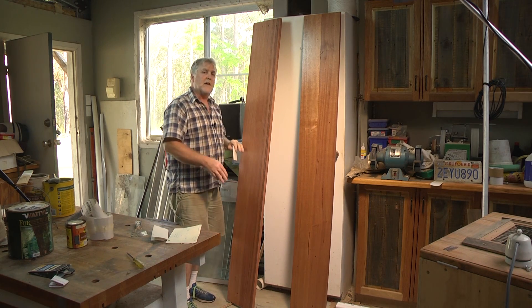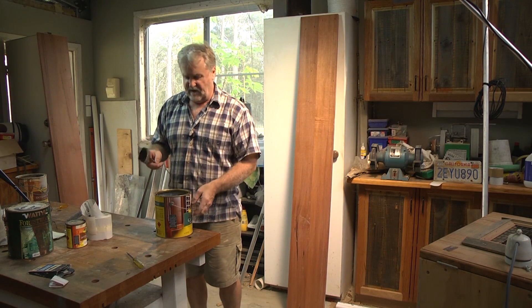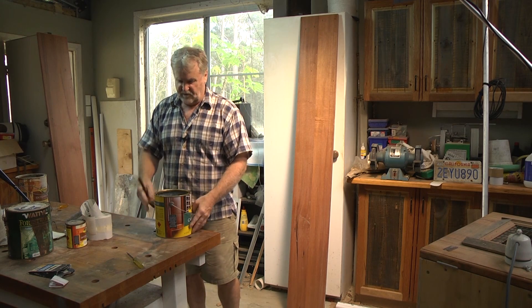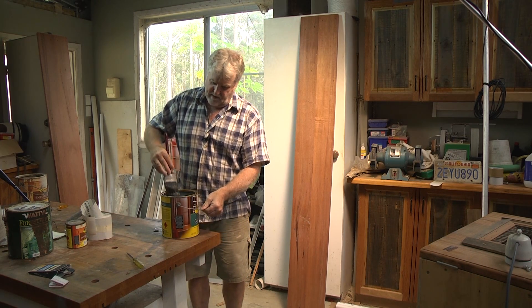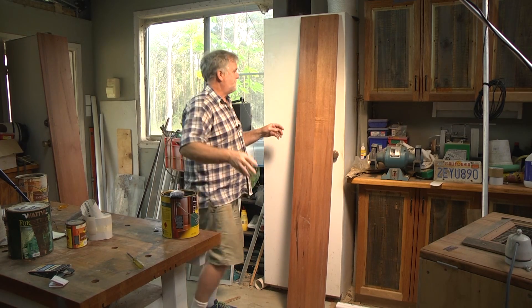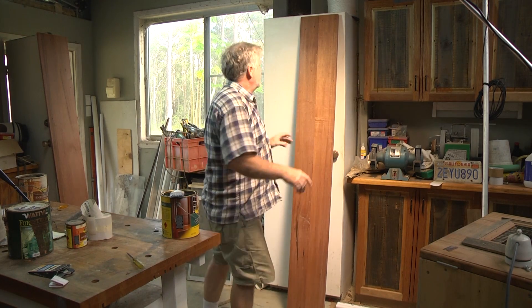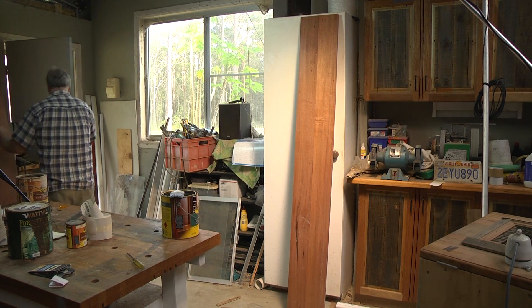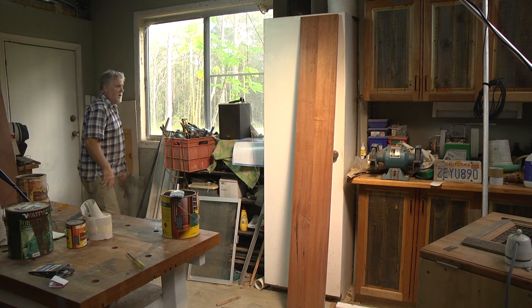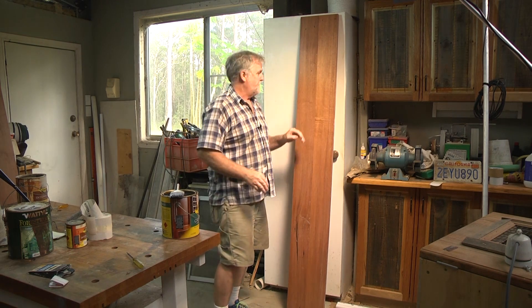I'll finish sanding these and we'll come back and put the final coat on. Two things before we start, guys. One, I did exactly the same thing as yesterday — I've put in a little bit of turps, paint thinner, into my clear coat, just to thin that out a little bit. You're better off too thin than too thick. The other thing is, I'm in my garage. I've got a door open here and the big garage door open on that side. There's a bit of wind coming through, so I'm going to close this door. What you'll find will happen if you've got windows and doors open is the wind coming across the surface will set your material up too fast. You don't want any wind. Close your windows, close all your doors, and you'll be good to go.